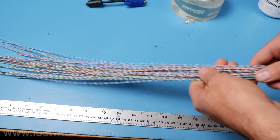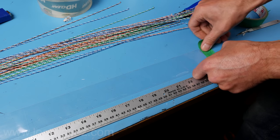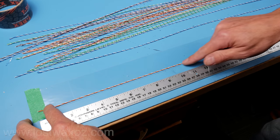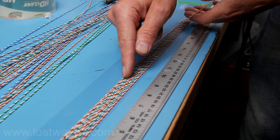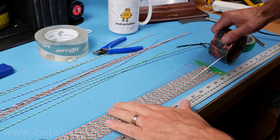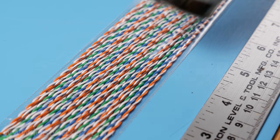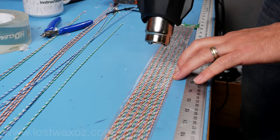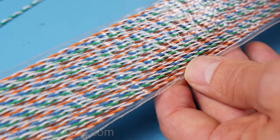Now we're going to use these wires to make the ribbon cable, and I'm using T-Rex tape to hold them all together. This tape is kind of like a clear vinyl — thicker and more flexible, not at all like regular packing tape. Tape down your tape sticky side up, then start laying down your nice straight wires. Make sure to leave some room between the wire and the outside edge of the tape — actually leave a little bit more than I left here. Keep adding wires side by side until you've filled up the tape strip. I ended up fitting 21 sets of wires, though I'd probably do one less to give a little more tape on the edge. Once all the wires are laid down, put another layer of tape over the top, making sure the tape can stick to itself on both sides. Then grab your heat gun and start warming up the tape — as it warms up it gets soft and flexible and maybe shrinks a little, and you can press it down against the wires so it conforms to their contours, which helps it look a little less homemade. Once you've heated and squooshed one side, flip it over and heat and squoosh the other side, then cut the ends off flush.